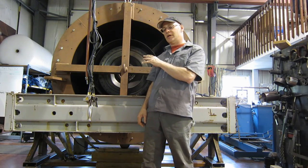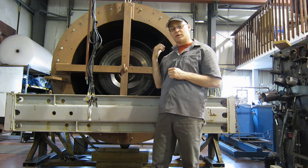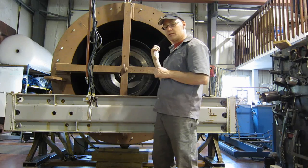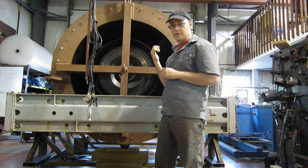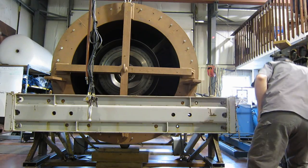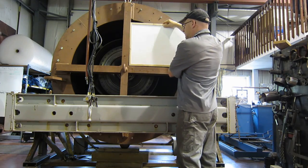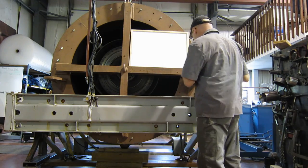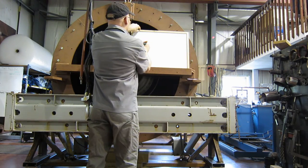The power turbine does that. Its output is at less speed and more torque than the engine. This engine spins at 9,200 RPM. This power turbine spins at around 3,000 to 3,600 depending on the application. And how does it do that? Well, with the handy help of a little whiteboard, I'm going to take a very quick drawing of the LM2500.